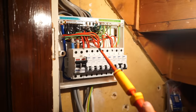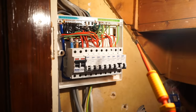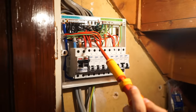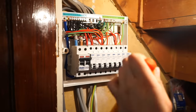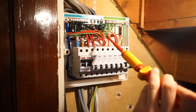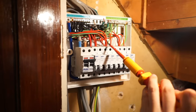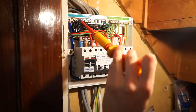Okay, so I'm looking here to fill out the section of the EICR, schedule of test results, for R1, RN and R2. So I'm going to separate the end-to-ends of the ring final circuits. So that is circuit 1, 2, 3. So we count along here, 1, 2, 3.